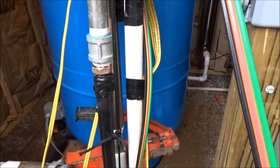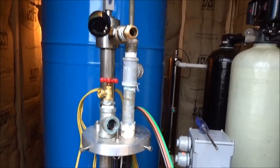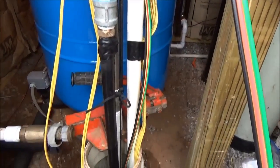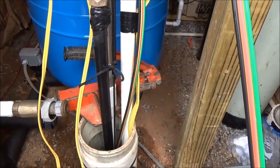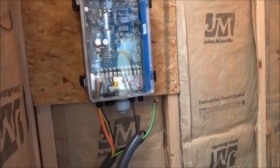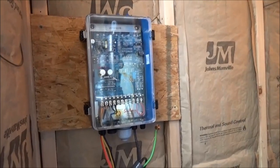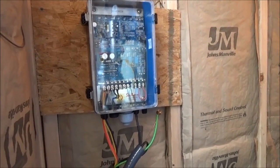You want to design for installation and removal, and sometimes it's hard to figure out all those variables. We are about to set it in and hook it up to the controller, which we've moved into the pump house based on voltage drop calculations, wire sizes, and a couple of other variables — changing up our typical installation to put the controller nice and close, protected near the well.